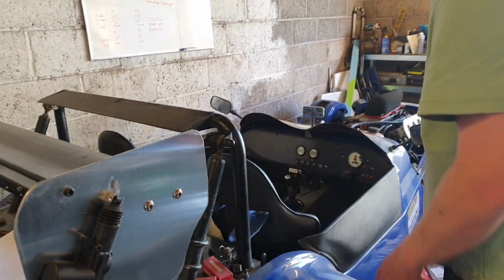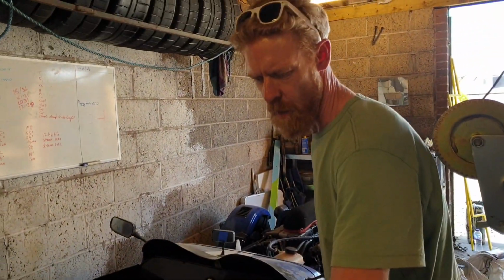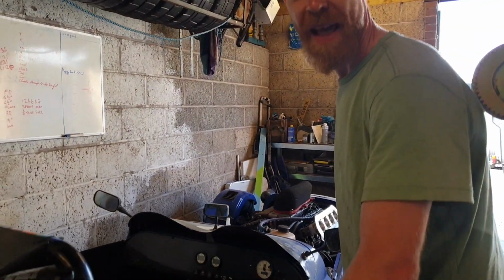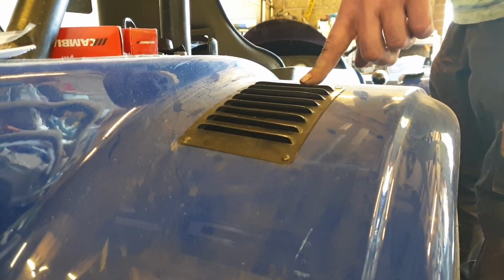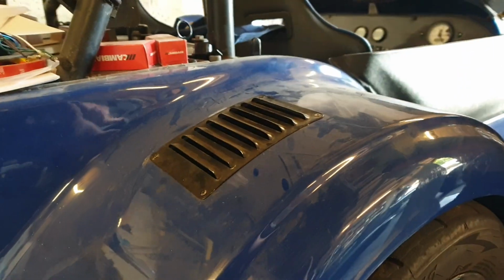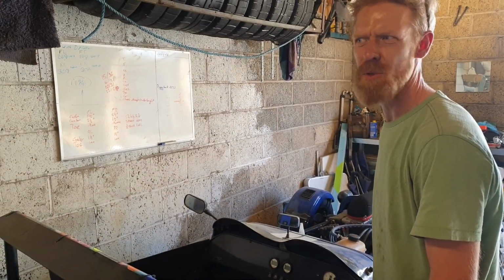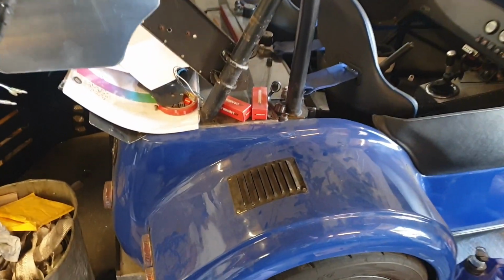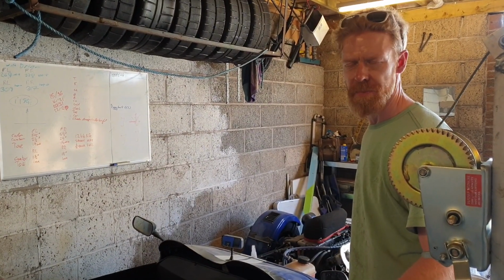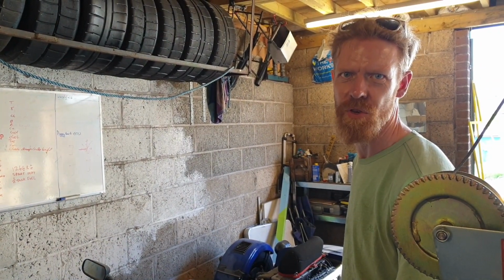We also have, you might notice that all 7 type cars have a bit of an issue with their wheel arches, that they trap an awful lot of air under, and you get lift problems. So you might notice on here I've used louvered vents, bought as doubles at £1.50 each from Tool Station, I think. Painted with also Tool Station's own spray paint. It's not the ideal solution because it's, shall we say, a lift reduction strategy rather than a downforce creating strategy.